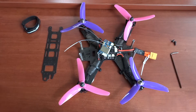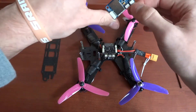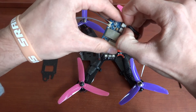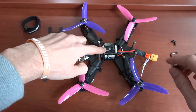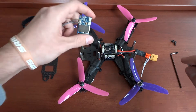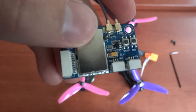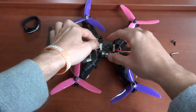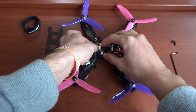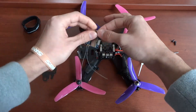The next thing you have to do if you're running PPM is go into Cleanflight and change the settings there. If you're going to run a serial protocol such as IBUS for FlySky transmitters, you do the same thing but use your IBUS port here and whichever port on your flight controller supports serial. I'm going to take my IBUS port and plug it into my UART that is mapped for serial.